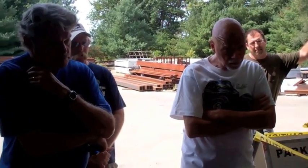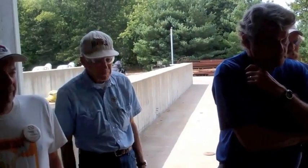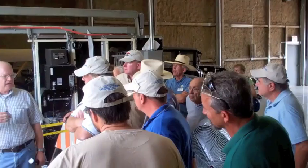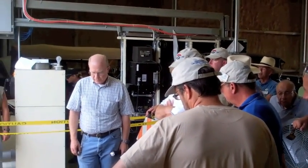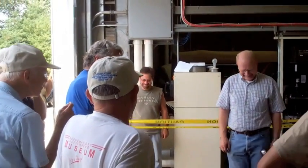If conditions are changing, then the inertia of these rollers is a factor. A steep angle on a dyno graph will have a little step in it somewhere, a little knee, and that's the true reading right there. In fact, people that run them fast, if you had a whole bunch of cars come through here, we did, I think, 30 or 50 ghosts one time, we were just running them through. I knew I could run them up, load them down, let them run up to the absolute knees and know what we had. That's good for cars that get hot. Yeah, right.